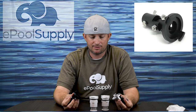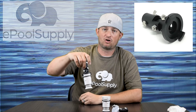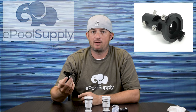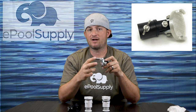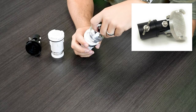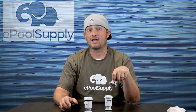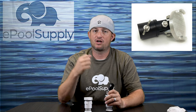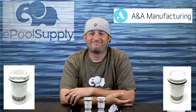For the Gamma4s, there's a plastic tool and a metal tool. The plastic tool is good for standard pop-up heads — they clip in with a quarter-turn lock so you can grab the pop-up head, put them in, and take them out. If your pop-up heads are new, go ahead and use the plastic one. If you're a service professional doing this all the time, the metal one is great because you can put a lot of torque on it without breaking the tabs off the bottom. If you have old stubborn pop-up heads, be careful with the plastic tool — those tabs will break off if you over-tighten. It's a simple quarter turn in and quarter turn out.